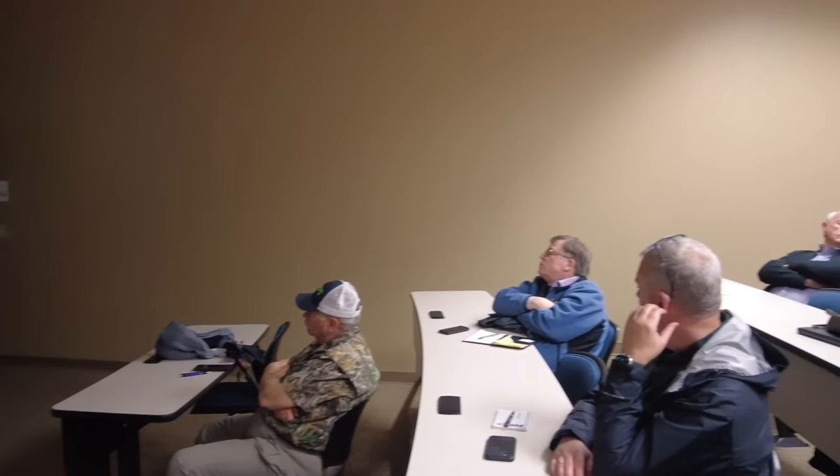Yeah. I came in just a few minutes late. Did you talk about an end-fed half-wave? Yeah. Well, an end-fed half-wave is just a random wire antenna fed with a balun. Okay, but it's half-wave length. And the balun takes out some of the problems that you have tuning, because you're tuning through the balun.